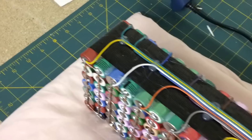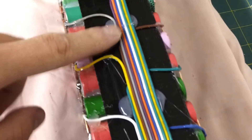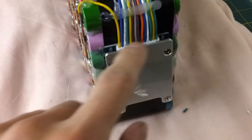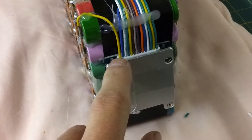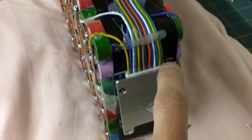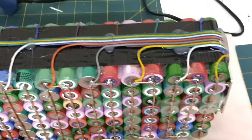Just finished soldering up the BMS on this now. This is the neatest job I can do. I've put hot glue in the various places there to try and seal it in place. It seems neat enough and strong enough. I've yet to test whether it's electrically sound. I will be removing the plug from there — that was just to secure it in place where I wanted it — and then checking each one of these in series. It should be zero from there, adding up to about 46 or 47 volts at the end because it's a bit discharged. My charger is in the mail on the way, so I really can't wait to charge this pack.